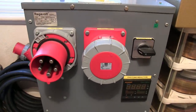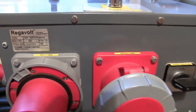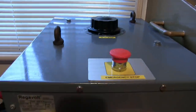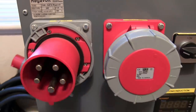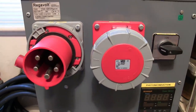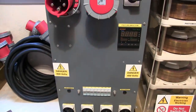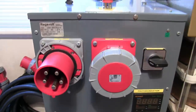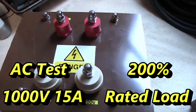Some of you might ask why I've got a three-phase plug on my variable power supply when I'm only using single phase. The answer is that if one day I want to convert this thing to three phase, it's just moving a couple of wires about inside — job done. The plug is there, but if that was a single-phase plug I couldn't run it on three phase. With a three-phase plug there's a choice of either. This transformer has become an absolute dream.